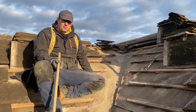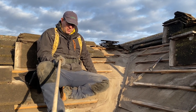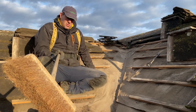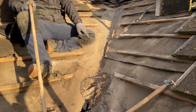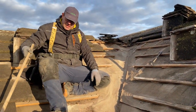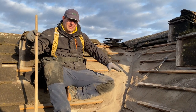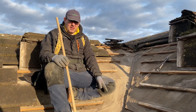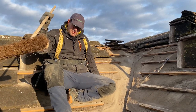We've got to get it tidied up and put back together today because we're on the road with scaffolding and getting trouble. So we're going to put those tiles back in, but we're going to refelt all this. I'll probably double felt this in the bottom. Normally I'd only single felt it. Double felt it, and then we'll bring new felt from here into the valley there. So there'll be loads of felt in the bottom of that one we've done to carry it. And put it back in.